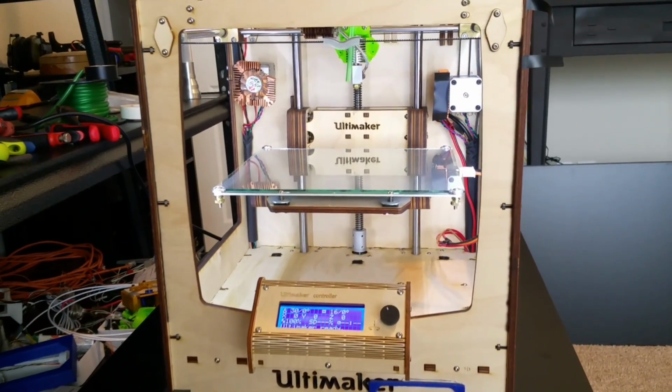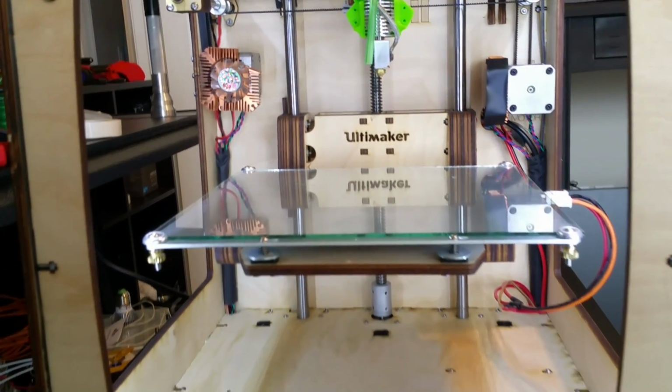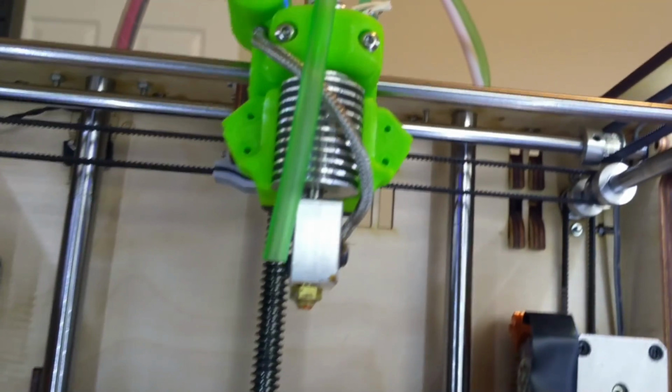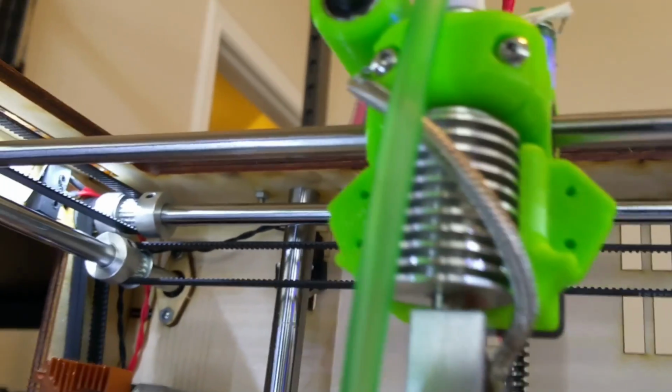After everything is plugged in, double check to make sure the wires are in their proper location before powering on the printer. After turning on the printer, check to make sure the hot end is reporting the correct ambient room temperature. If all that is working, then re-zero the Z height of the new taller hot end and you are done! I used a normal piece of printer paper, folding it over twice to allow for about 0.2 millimeters of clearance between the nozzle and the heated bed.